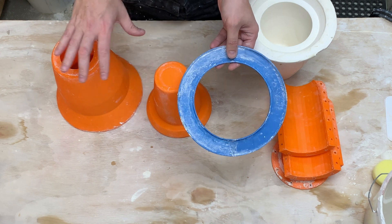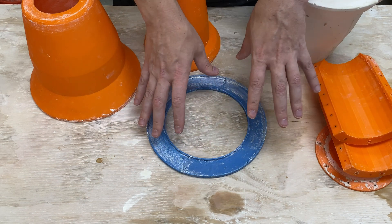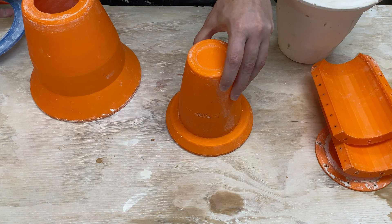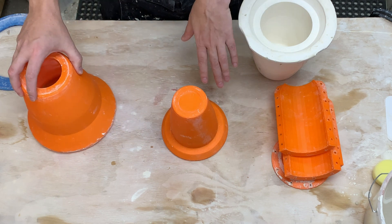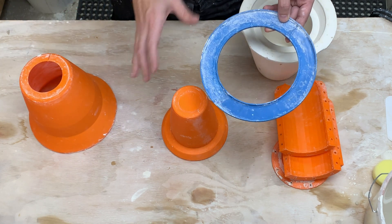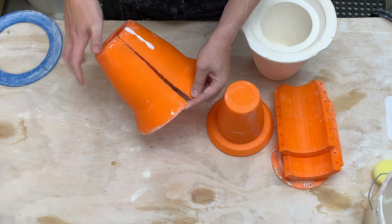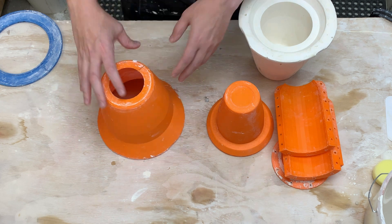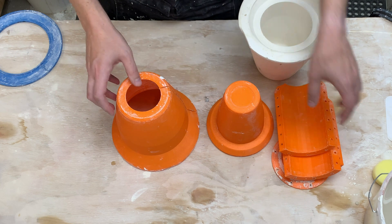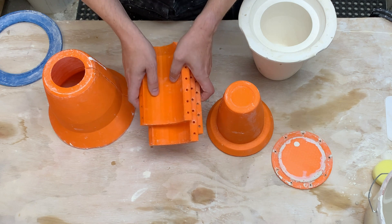The other part was this ring here that I need to connect together. Several comments suggested basically putting down a bed of clay, squishing this and the outer mold into the clay, and then pouring the plaster that way. I do think that would work and it would get rid of this joint. But I am rapidly going to need to deal with joints in these 3D printed pieces anyway. I cut this and I'd really like to be able to pull it apart to release the plaster. That also helps me work around some build volume issues with my 3D printer so I can print larger outer molds.